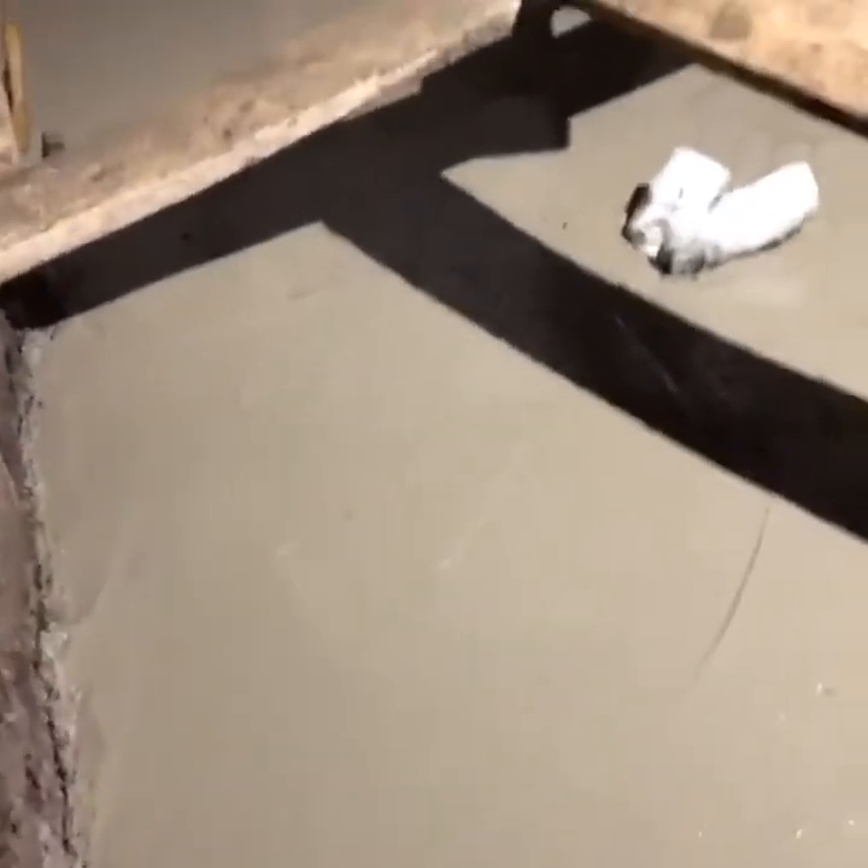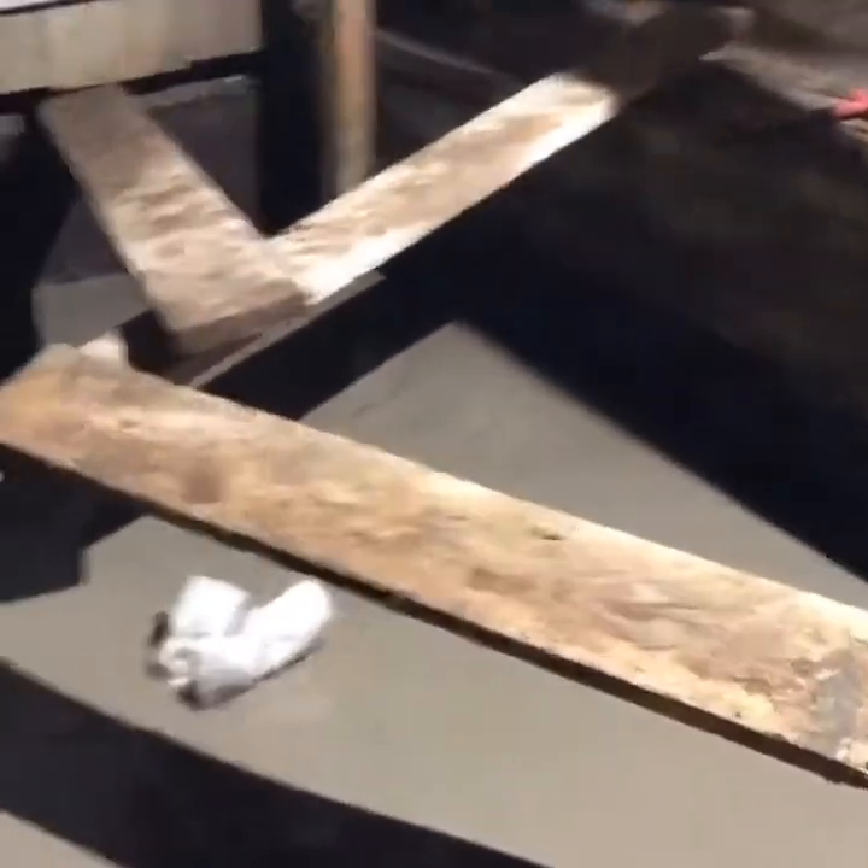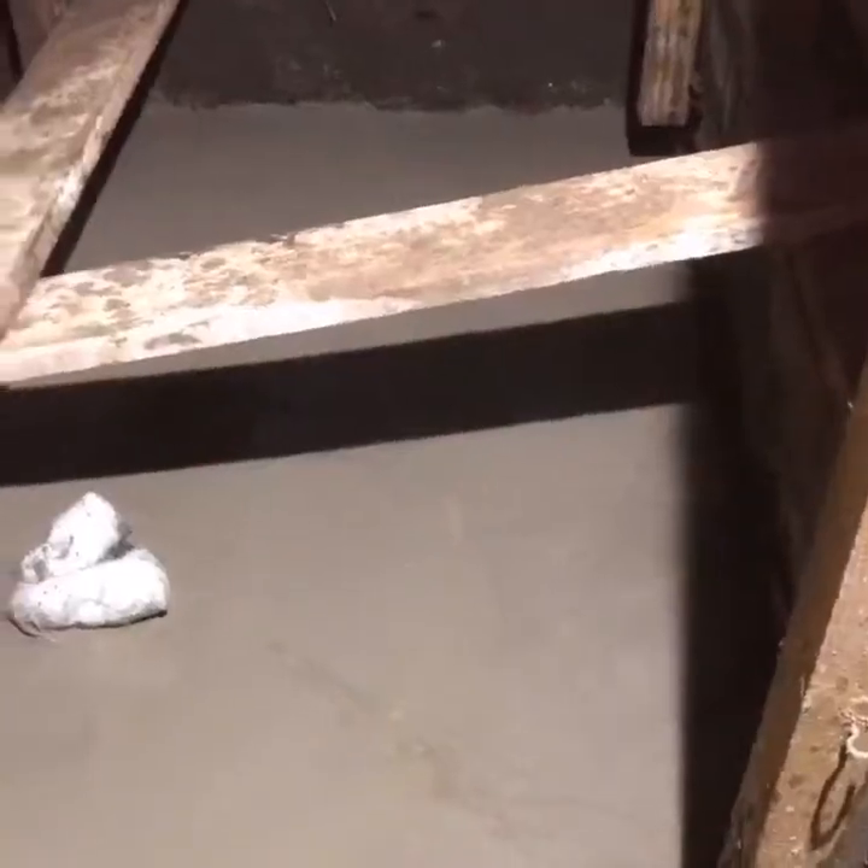We're under candlelight here — check out all the fireworks, what a great night to be out. The slab is down. I'm going to give it another skim but there's a six-inch fall all the way into the centre of the drain. Just done the pump house too, into an eco drain, so it all slopes down — if it overflows it all goes straight down the drain. A bit late tonight, I've still got to set up the filtration system again for the koi so I'll be out here for at least another hour. Not my fault — the cement lorry was an hour and a half late.